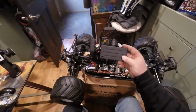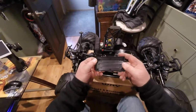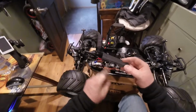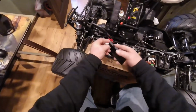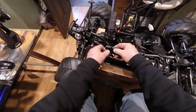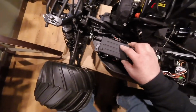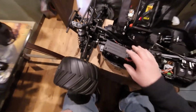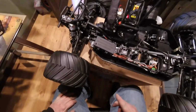That's fine. So, like I said, off camera, what I did was I took the battery door, drilled out a 5/16 hole, put the LED grommet in, so I could put the LED right in there like so. Like that. And there it should be. I'll have to push it up in there once I'm ready. And that's going to be at the bottom, right by the on and off switch. For now, it's a good idea. But in the future, that might need to be moved.